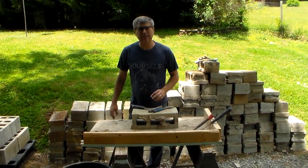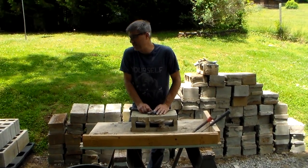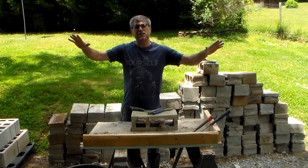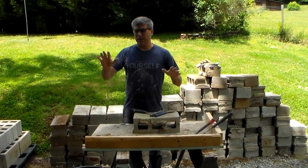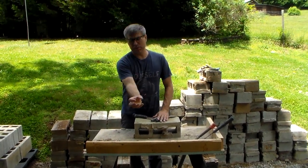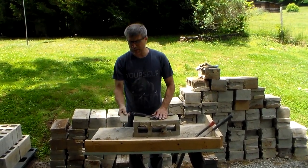I've seen so many people have a driveway cleaned off and they come in with stone that is just like crush — it's not going to make a base. What happens is it rains, people drive on it, even the contractor, and before you know it all of that nice small stone is pushed into the dirt. It's worthless. Big rock — this stuff is also good, this is the junk.